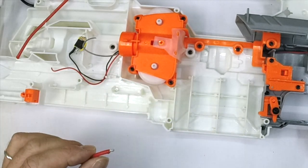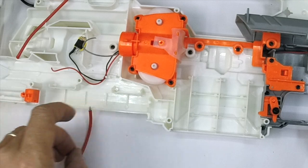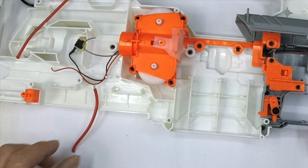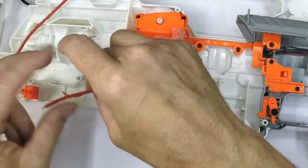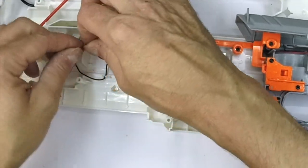MTB have got a nice soldering video — go watch that if you want to learn how to solder. I only ever use leaded solder and a separate flux — this greasy stuff that I dab on with a cocktail stick. Not everybody does it that way but that's how I do it. The next thing I need is to get the XT60 in, but I also need to put this little feed into place here — I'm probably going to shorten that wire a bit, just leaving enough to allow it to tuck up there.